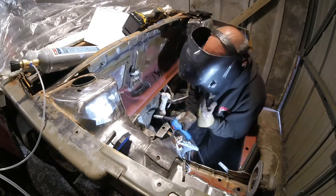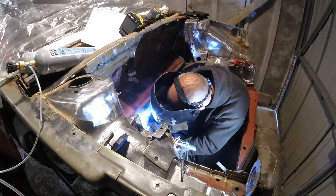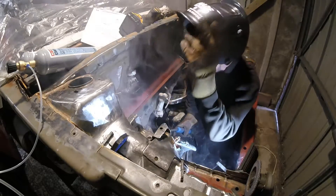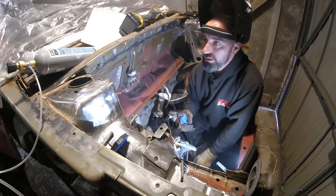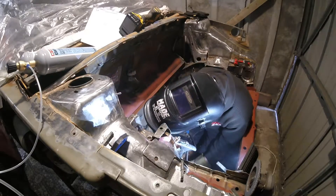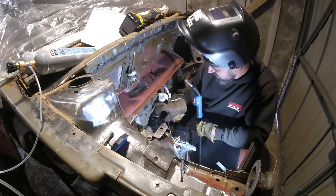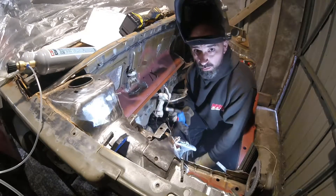No changes other than the gas — see if that makes any difference. What a difference that makes! I'm going to do this other one and see if that was just a fluke. You'd be really interested to know I've not changed anything, but when I was doing that one I dialled the voltage back to about three and a half, wire speed at five, and we're still getting very pitted messy welds.